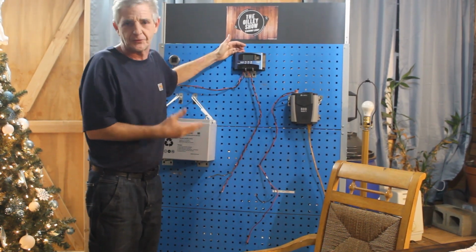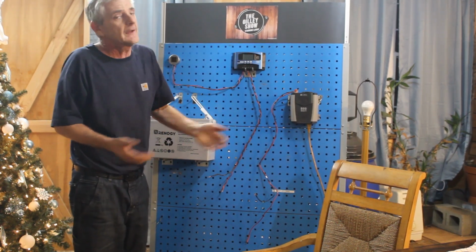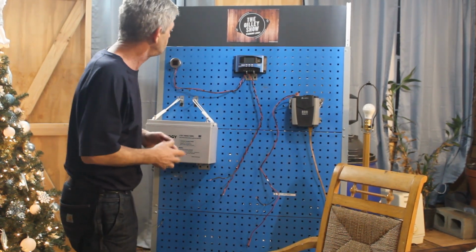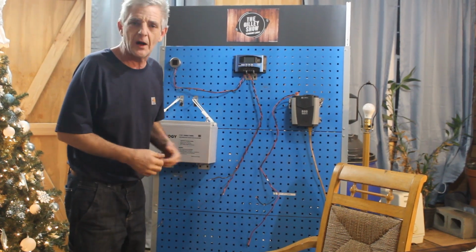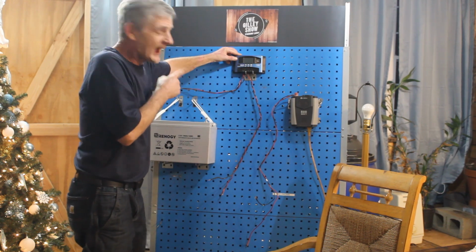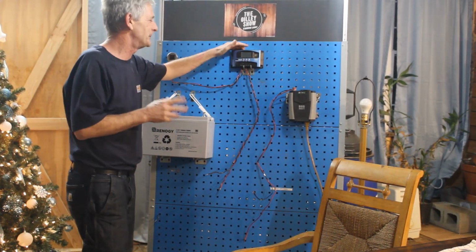They work like a switch to turn things on and off to charge your battery. Do they work? Yeah. And they were used for a lot of years before we ended up getting the MPPT controllers, okay? And they do the job. Do they do it as efficiently and as well? No, but they still work. And this is actually a controller I started off with charging my LiFePO4 pack, so.